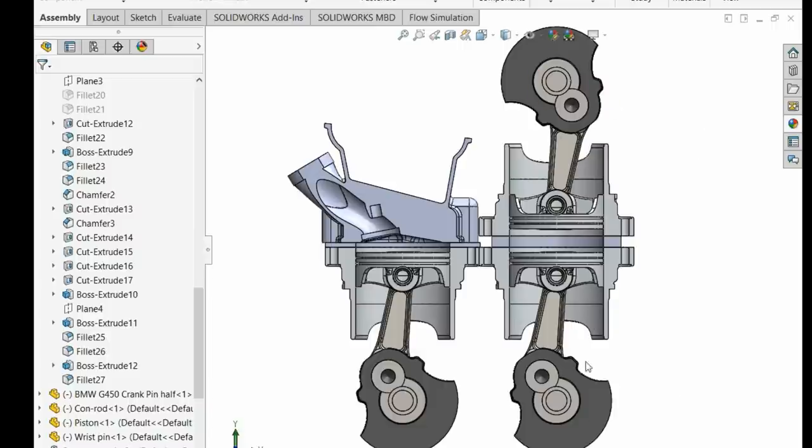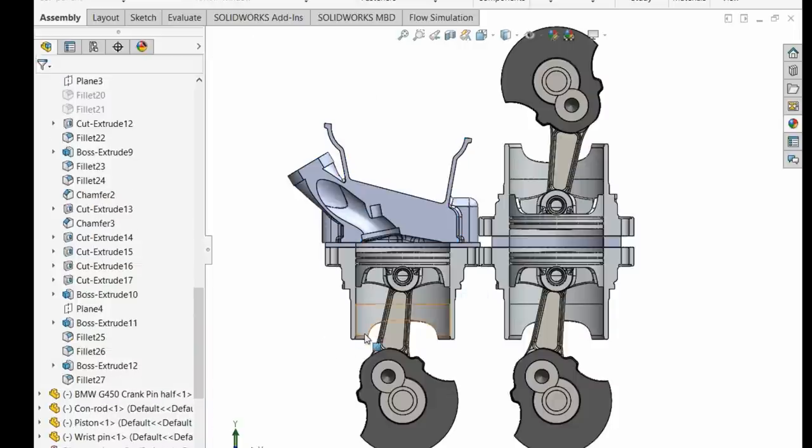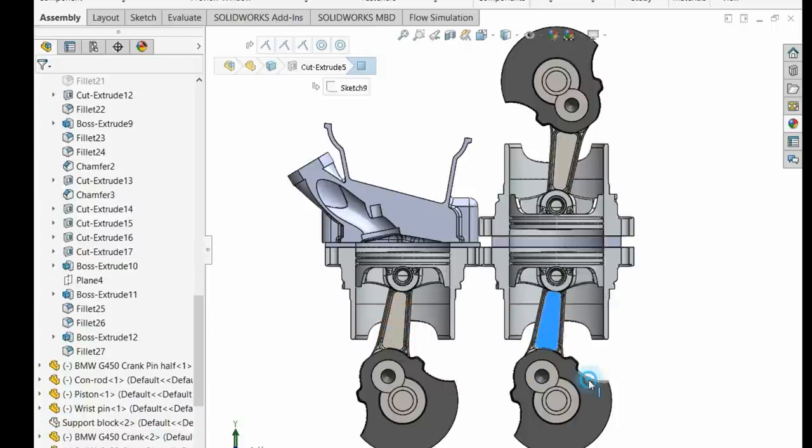Because you would make this system on the right, this opposed piston jobby, a two-stroke, then this is going to fire twice as often as this is, so you get the weight benefit of not having a head, and you get to fire twice as often. But let's just imagine we could make this system a two-stroke, forgetting the cylinder head, with ports and stuff, then this is just double this.